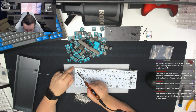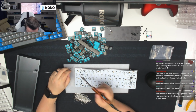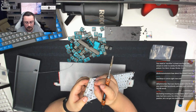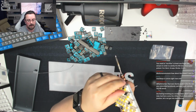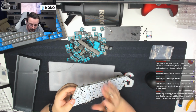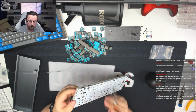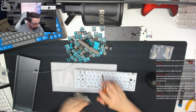And the reason we're going to do that, he says, there we go, is because now that's soldered in place. If that's not right when I come back to it later on, so if that wasn't in fully, I could heat that pad up, I could push it around, I could line up the LED, I could move it into any position I wanted to, and then I could just reflow that solder and it would be fine. And then once I've done that, I can then go back and resolder the other legs, clip them all, and then nice and easily done. So that's how we're going to do it.